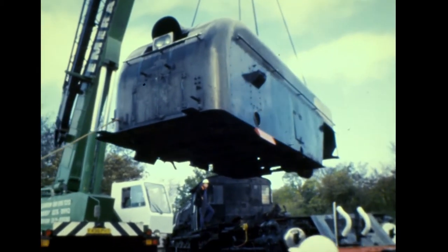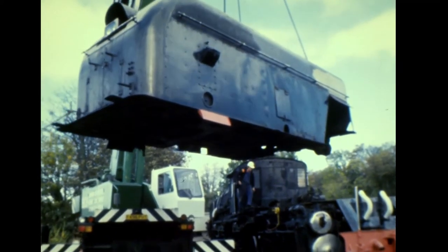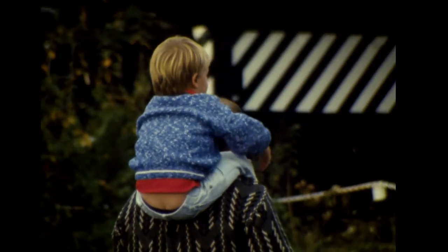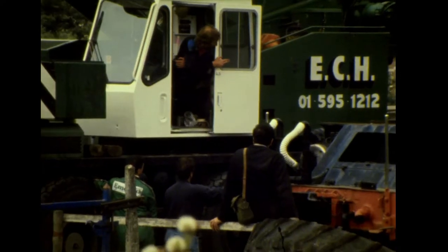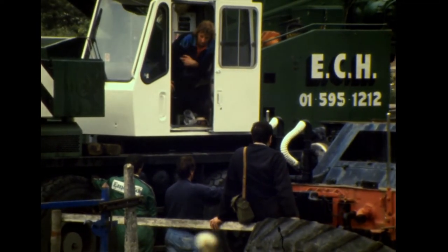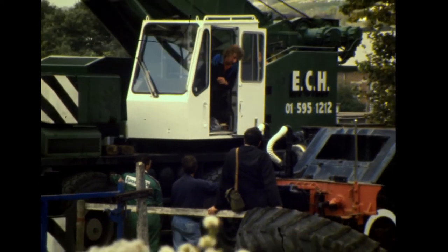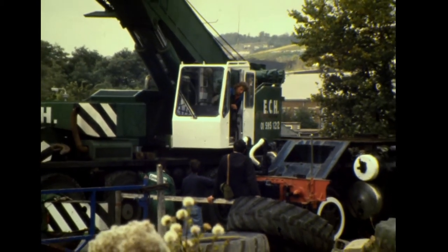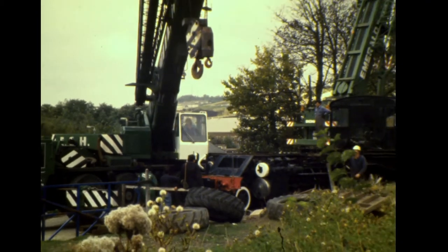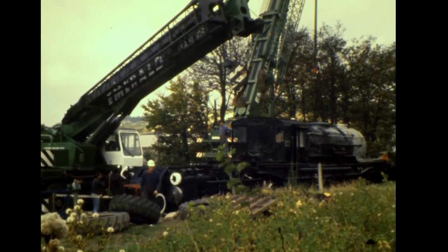We've had the wee odd thing, which you had to look into. What you did in the drawing office, you worked out the centre of gravity, you superimposed the beam by drawing on the loco. Everything by calculation looked right, but the practical side was the final. You went down to the dock side. The lifting beam we had had a series of holes along the bottom, and to bring the beam into the centre of the loco, or to the centre of gravity, you moved the third hole at the front, the last hole at the back, and that kept the slings clear of the loco for damage.